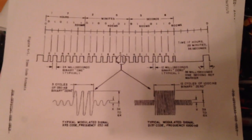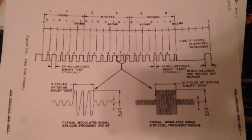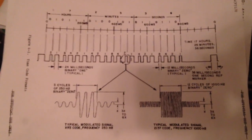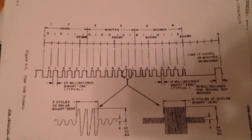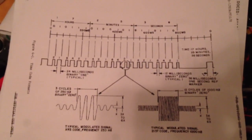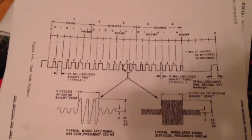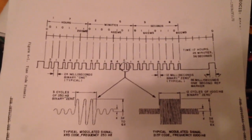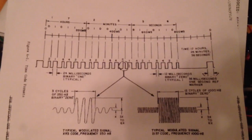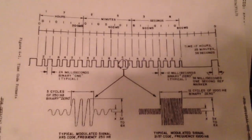It's been fun because I've realized that the way they used to think about these things back in the 70s is very different than the way we think about them now, whereas we would almost always intrinsically associate 1 with high and 0 with low, and then would maybe vary the voltage accordingly, maybe just by the length of time it was in either state. They went about it a little bit differently. They encoded 1 in binary as a long pulse and 0 as a short pulse, and a low or a nothing as just padding.